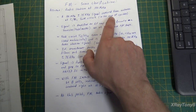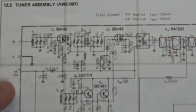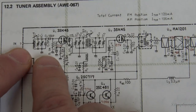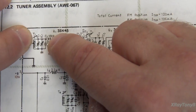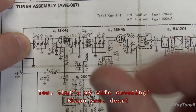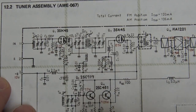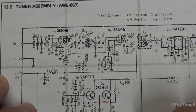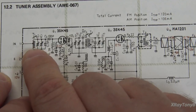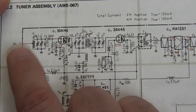In the case of our SX-1050, the signal is captured from the antenna where it says 'in,' and it goes through what we call a tank circuit — basically a combination of T1, this little transformer, and VC1, the variable capacitor. TC1 is that little trimmer cap we were trimming on top of the gold box. All this does is fine-tune how this thing works. By adjusting the capacitor when you turn the tuning knob, you're changing the resonant frequency of this tank circuit.